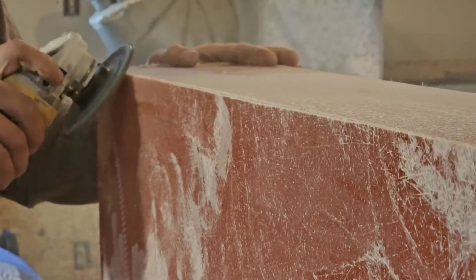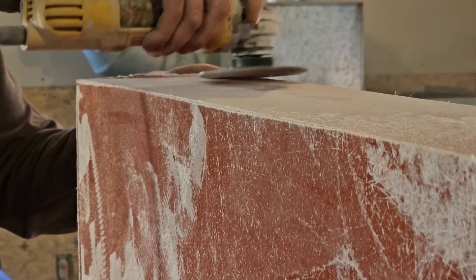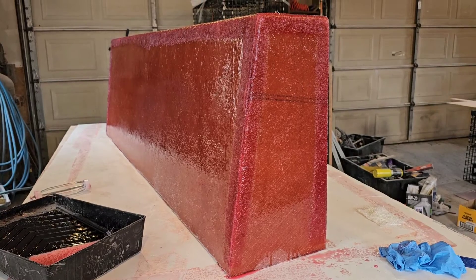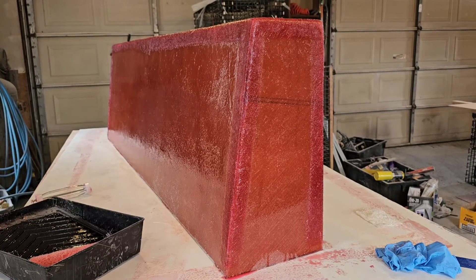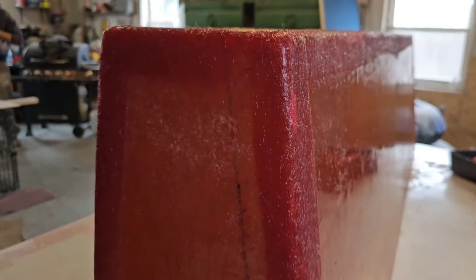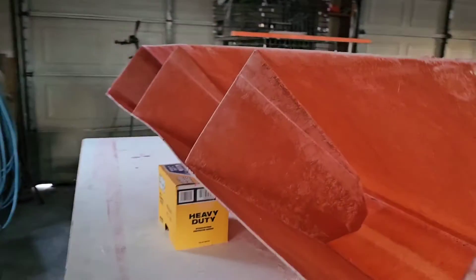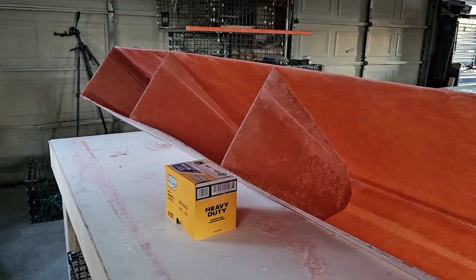I had some issues with my wood boiler at this point, so Jeremy continued on. What he did is he took fiberglass and layered everything up. Later in the afternoon I met back up with him — you can see he's coated around all the edges with fiberglass in small strips to strengthen the shape so it holds very well and is strong and ruggedly built. You can see the overlap showing how everything is holding into place. Once the outside is done, the inside has to be done too. The baffles inside get cut up and fit in to make sure everything fits before everything gets covered in resin in there as well.